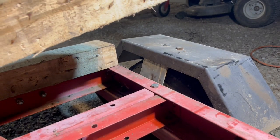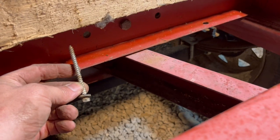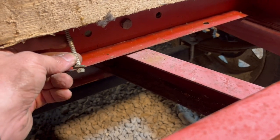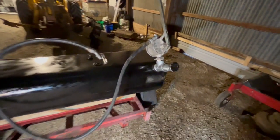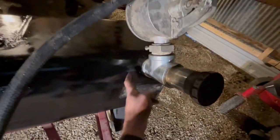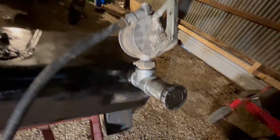The tank would run over and hit the tops of the wheels, so I'm going to put these wood beams on here to space it up, held in with these screws we pulled out of the original wagon. Here it is put together. Back here I installed a diaphragm pump. Luckily this was standard two-inch pipe, so I was able to put a tee and a nipple to the cap here, and then go up for the pump.